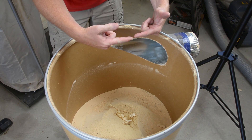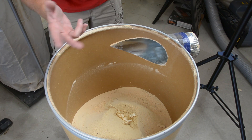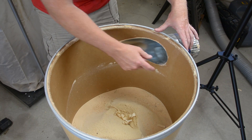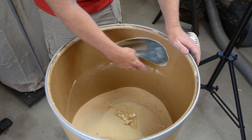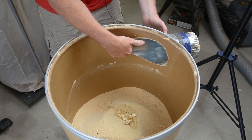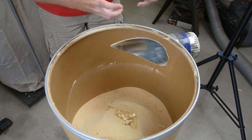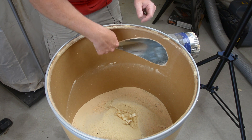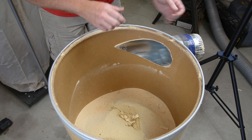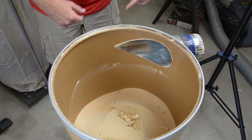You'll have to make a couple of cuts, but you can cut this stuff — it is just cardboard in the end. There's a second template that wraps around the pipe itself, tapes in place, and gives you the line to follow that you can cut with tin snips, a saw, or a Dremel tool. When you're done, what you get is this nice, mostly flush fit — I didn't get it perfect, but basically these two things fit together just about perfectly. Some designs I looked at had tabs of metal on the pipe to give you something to screw or put a mechanical fastener in. I decided to go the epoxy route — some nice thick, heavy, almost putty-like epoxy all around the outside, filling in the gap. That does two things: it gives me a good solid sturdy connection, and it gives me an airtight connection. The putty allows me to fill in any little gaps where I didn't have my cuts just perfect.